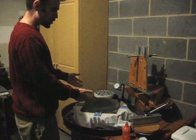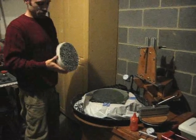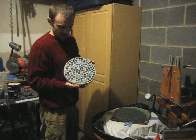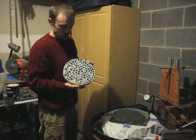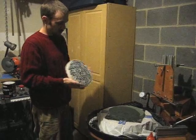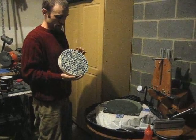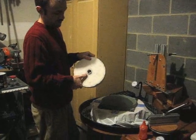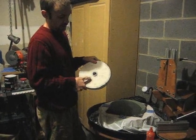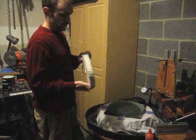I'm going to show you how the Mirror-O-Matic works when you're fine grinding. This is my tile tool. It's made of hydrostone and it's about an inch thick. My tiles are flattened marbles that I picked up at Jo-Ann's, or you can find them at any craft store in the flower arranging department. They were placed flat-down on the mirror and then I poured the hydrostone on top of them. Once the hydrostone was setting, I put in a one-inch PVC pipe end cap, and then I put some epoxy steel on the bottom because a lot of pressure is placed on the bottom of the end cap and it would bore through the plastic if I didn't do that.